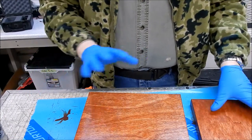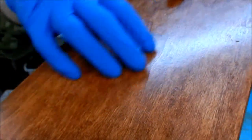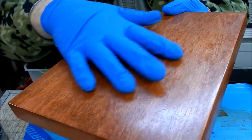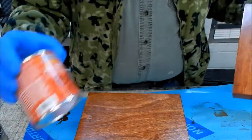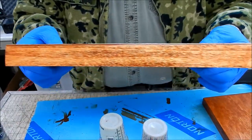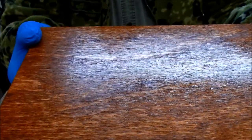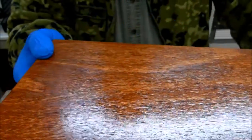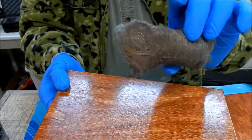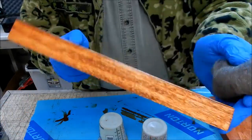We're back and I've actually got two different boards here. This is the board I just showed you. The finish is very rough still - the basswood just kind of fluffed up, which I've heard is a real problem with this stuff. I tried to find some sanding sealer but haven't been able to find anything locally. I tried some wood prep product on this one but it didn't really do anything - it actually made absorption a little worse. But what I did with this second one is, after I put a couple coats of stain on, I went over it with some four-ought (0000) steel wool, and it took all that off. The sides were actually almost glass smooth when I was done - I was really impressed with how well this worked.